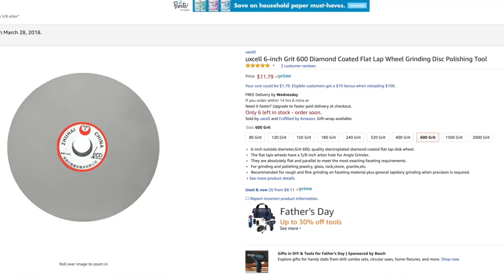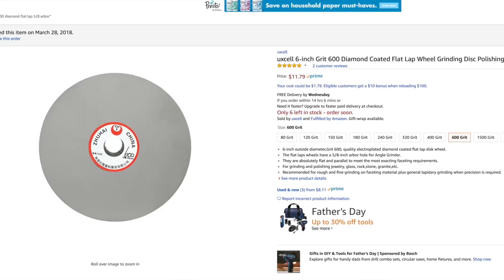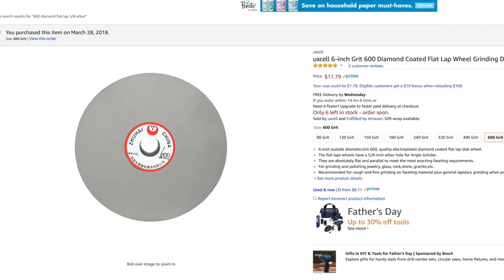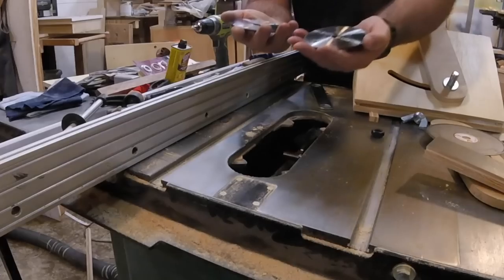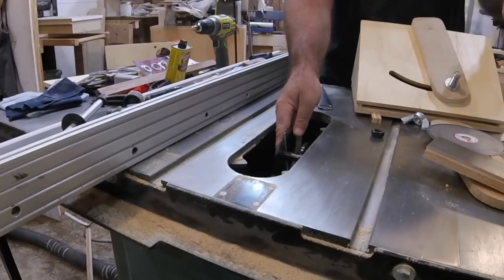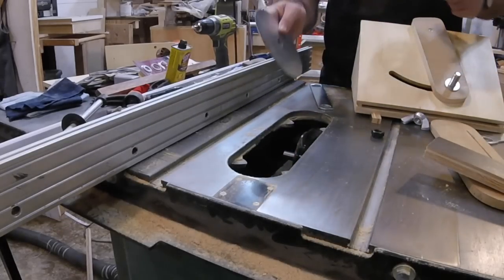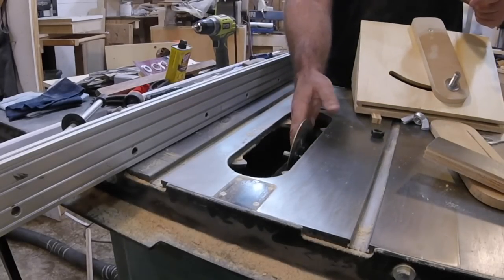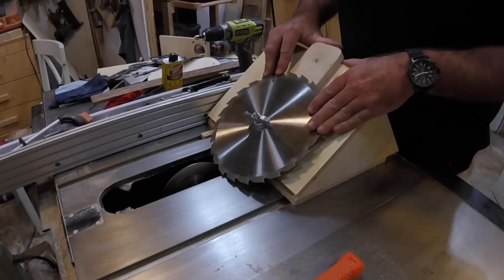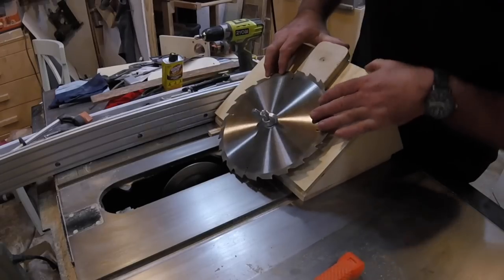As far as the disc itself, a wonderful person left me a useful comment pointing me toward a possible source for discs that would do what I needed them to do. Although I didn't use the same one he suggested, he did put me on the right track and I was able to find what I needed — I'll leave a link below for the exact wheel I used. These discs are really thin and I was concerned with stability, so for that reason and cost, I stayed with a six-inch wheel. I used stabilizers on each side of the wheel for added rigidity. As I'm sharpening each tooth, I use very little pressure — not only do I want to save as much carbide as possible, but I don't want to cause the lap wheel to deflect.